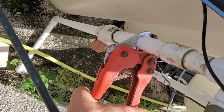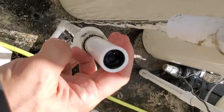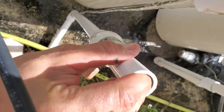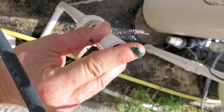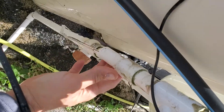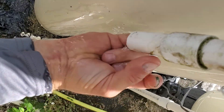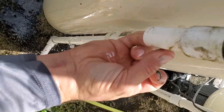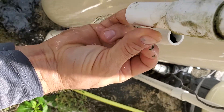So now we're gonna take a look inside your pipes here. This is the water coming into the house. You know, it's algae and things growing inside the pipe. What we should do is sanitize all your water lines. They do actually make ultraviolet lights to kind of prevent that from happening, plus the sanitation itself will address that. A UV light will prevent the algae or bacteria.